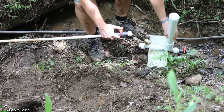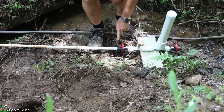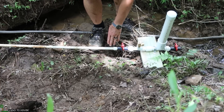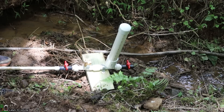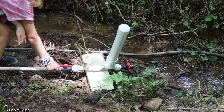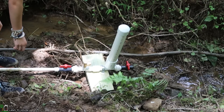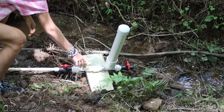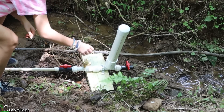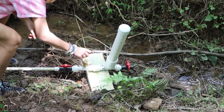I can turn off the valve here to connect this to the pump. It's very important to let the air that's in the drive pipe find its way back up to the bucket, so we're going to give this a moment to make sure all of that air has gone out of the drive pipe. Open up the red valve that's closest to you just by turning it. Water has just slammed the waste valve closed, so take a finger and push that golden valve back down, and then do that about 10 times — push once, let it close, and then do it again. Pressure is being built up in the tank, and as soon as that pressure reaches enough to keep the pump going, it'll start cycling on its own.